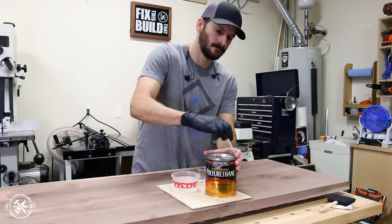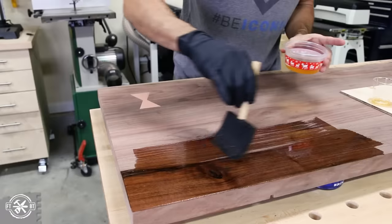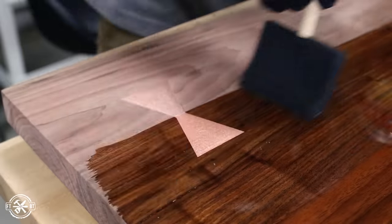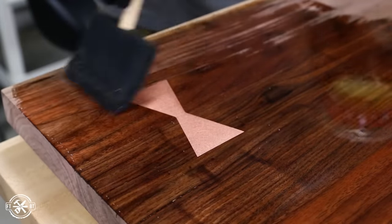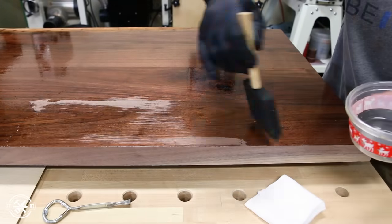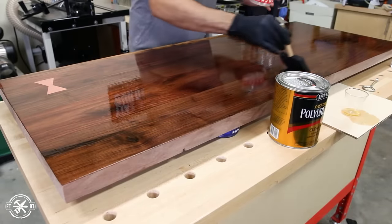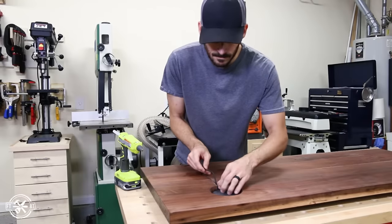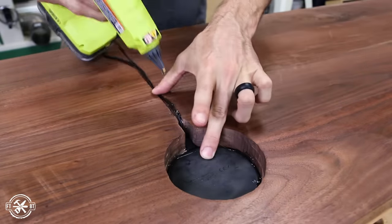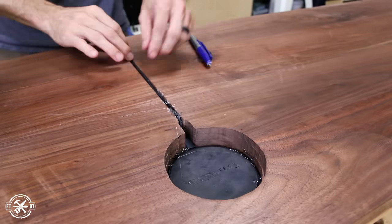Now is the part I'd been waiting for ever since I milled this walnut. For the finish I'm using fast-drying polyurethane from Minwax — a sponsor of today's video — an oil-based durable protective finish that really makes this walnut look amazing. Since the desk surface will get a ton of wear, this tough polyurethane is perfect for the job. I applied one thick coat with a foam brush and came back later with a thinned-down second coat for a nice smooth finish. When the finish dried it was time to install the charger — I opted for quick and easy mounting by hot-gluing it in. Put the glue in the channel and press the wire into it — don't hot glue all over the wire, it just makes a mess.